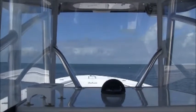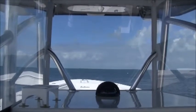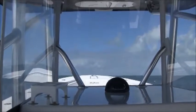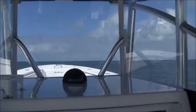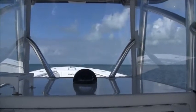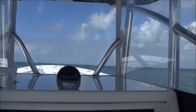I'm going to give it very little gas — I'm not going to punch it. A lot of boats you have to give it full throttle just to get out of the water. I'm just going to walk it up on plane slowly so you can feel how easily this hull gets up. We are doing 2,200 RPM, 14 miles an hour and we're on plane. This is perfect Wahoo trolling speed. No trim tabs needed — I don't have my trim tabs down. We've got about 100 gallons of fuel in the boat.